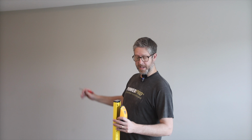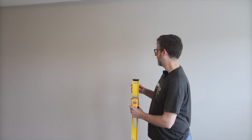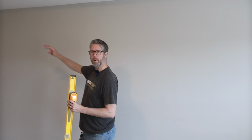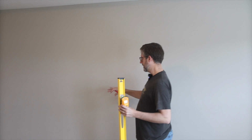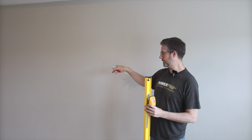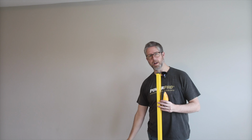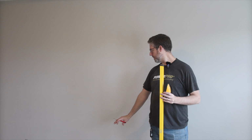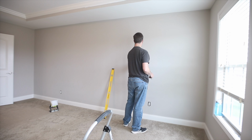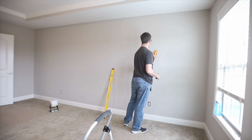It's time to lay out for this accent wall. We still have to do a little design work, but I've got a stud finder and a really long level, and I'm going to mark the studs all the way along this wall so that as often as possible, when we're putting up the MDF, we can hit a stud. I think that's going to be the best layout method for this. We are tearing up this carpet soon, so I'm not worried about making dust. We can just get to cutting in here and getting this wall going. I'm excited.